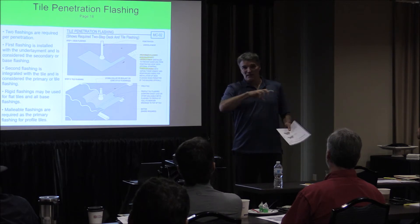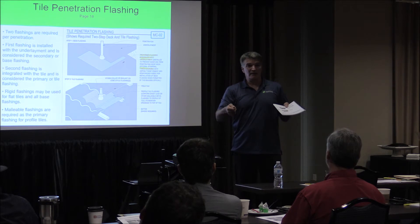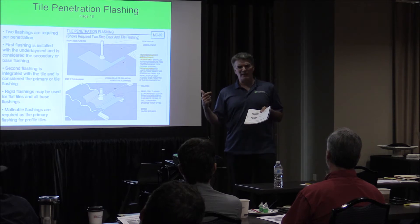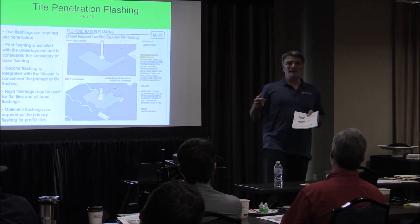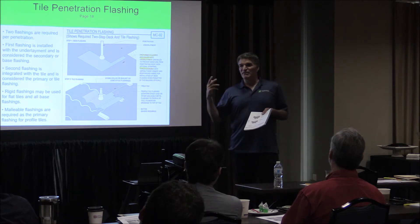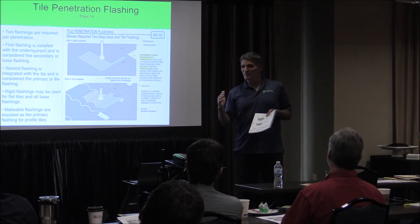When I started roofing, I actually did some roofs before I started my own company where we didn't put one layer of 30 pound down. It was on space sheathing — that means rafters or trusses with one-by-sixes across, spaced appropriately. We hung the tile on them and they didn't leak. No plywood, no underlay. But that's the way it was still done when I started roofing, up until about 1990 or 1991 it was still allowed. With proper flashing and details in many climates, you can do that — the pitch, the complexity of the roof, a lot of different things go into that.